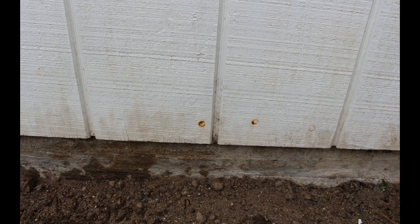Here's a question I'd like to help answer: Do galvanized nails rust? I've heard a lot of people say no, if it's galvanized it's never going to rust. I even heard carpenters telling me that years ago — you want to use galvanized metal. Well, don't forget that in some cases the galvanized is just a coating, and if that coating gets chipped, wears off, or separates, you are going to be more susceptible to rust.